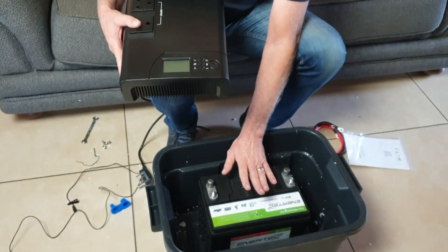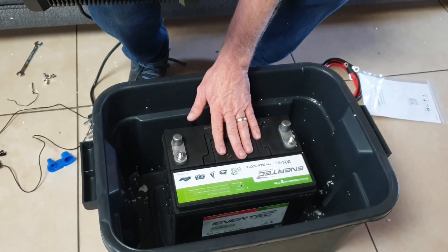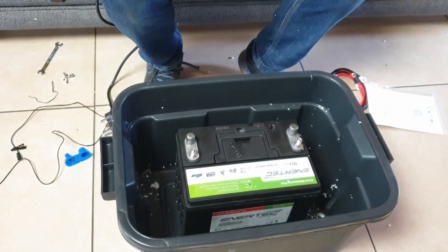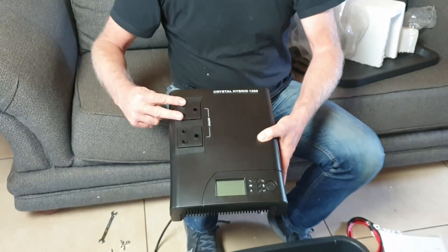That way your battery is going to last and give you a full cycle. This battery is designed to give 1600 charge-discharge cycles down to about 50% of its capacity. Part of what we do is show you how to manage your battery — how much power to draw — so you don't end up damaging it.